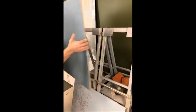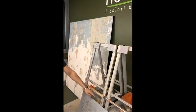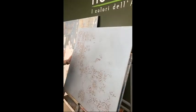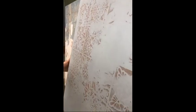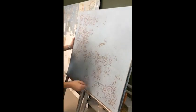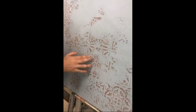We have left this panel to dry — it takes about 4 or 5 hours. When it's totally dry, we go back and sand it in some areas. This is where we see again the brown of the first layer coming through. The concept is the same: we try to create a surface that is not perfect, but leaves the marks of time showing through the wall.